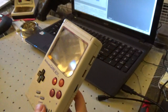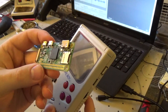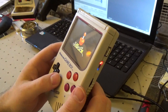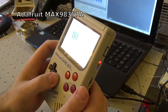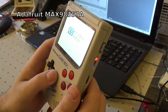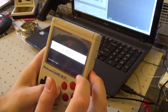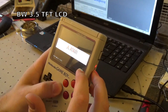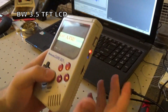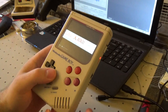It is using a Raspberry Pi Zero computer with a custom Linux operating system called RetroPie. For the audio, I'm using an Adafruit Max 98357 I2S digital-to-analog converter and amplifier. The screen is a BW 3.5 LCD screen for a car, and there's a little 8-ohm speaker from a laptop in here.